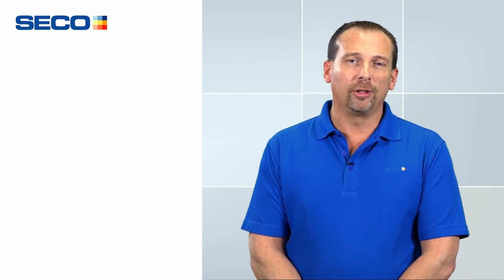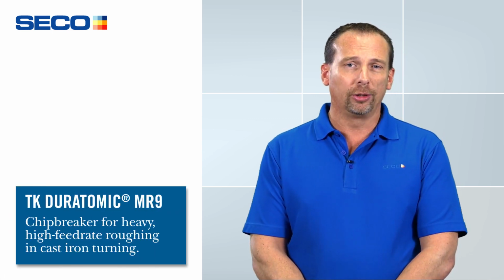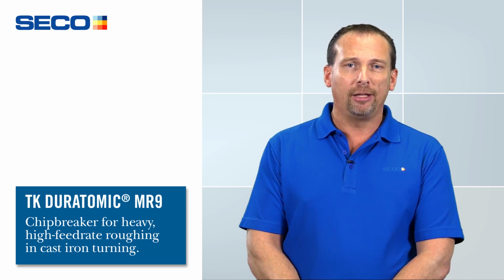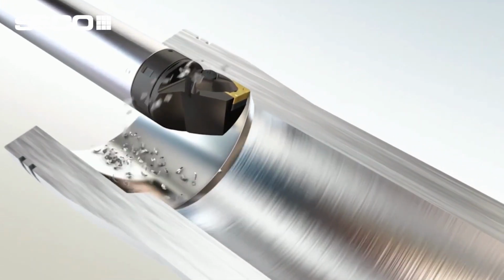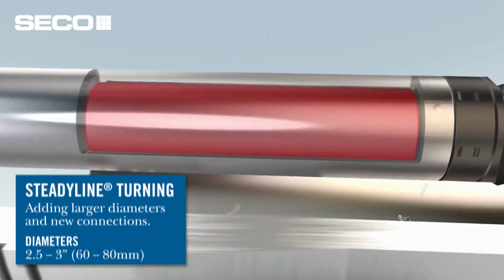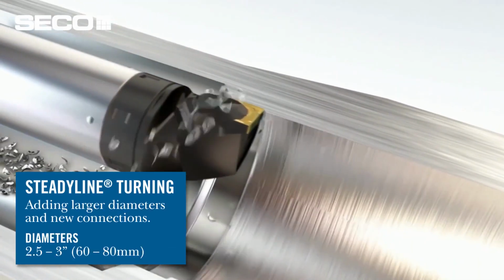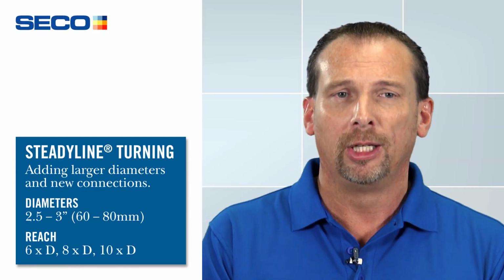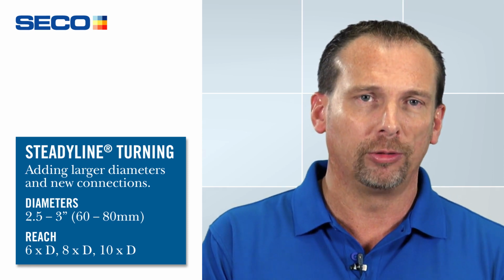Some of the other additions within the turning product family is we're going to have a new chip breaker for the new chrome cast iron Duratomic grades, MR9, which is going to be specifically for heavy, high feed rate roughing. Then lastly, we are expanding the range of steady line turning bars into the larger diameter. They'll be available in 2.5 and 3 inch, along with 60 and 80 millimeter diameters. They'll all be available in length to diameter ratios of 6 times diameter, 8 times diameter, and 10 times diameter, so you can suit different applications.